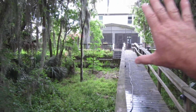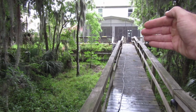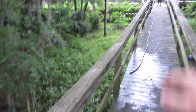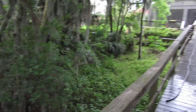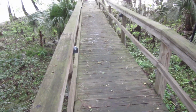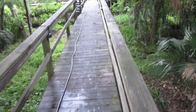So he already painted all that gray up there, and it connects to this actual dock here, this walkway and dock. And if we did this whole dock and walkway with a semi-transparent stain, and it butted right up against that Deck Over painted deck, it probably wouldn't look very good. So we decided to go to a solid color stain. We'll match the same exact color. It's actually a Behr color called Pewter.